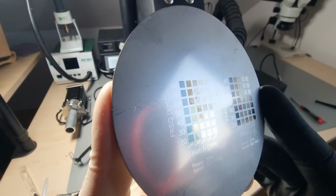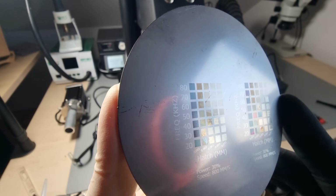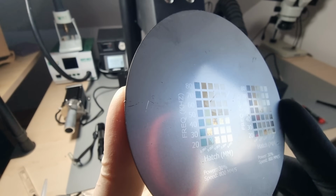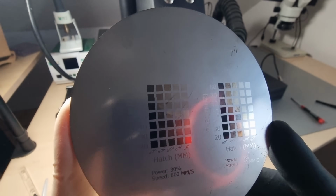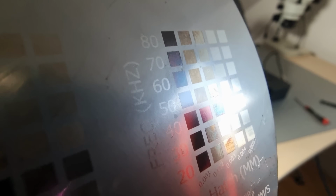I'm not entirely sure yet how the Max Photonics laser source in the ComMarker B4 works. I have a Chinese manual for it and in there both the MOPA and the Q-switch keywords are mentioned. So I'm afraid we really have to take it apart a bit further.